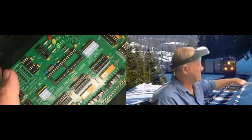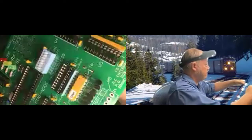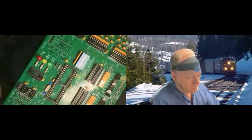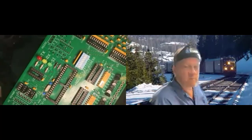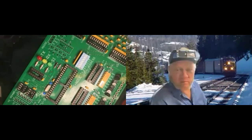You know, sometimes when you can't wait for the delivery, you can use a toothpick to apply a very tiny amount of paste flux. And also stranded copper wire as a substitute for the braid to remove excess solder. Nice. Yep.